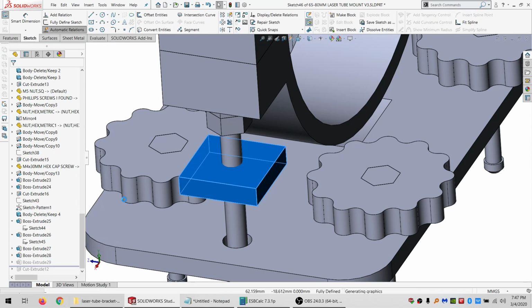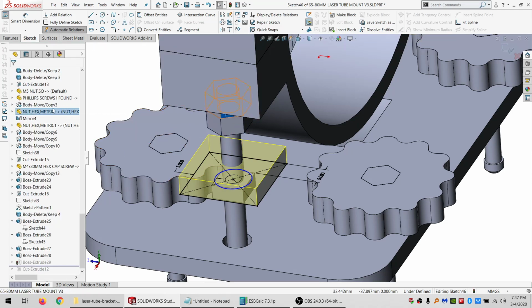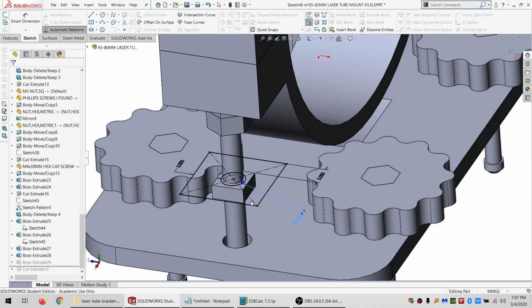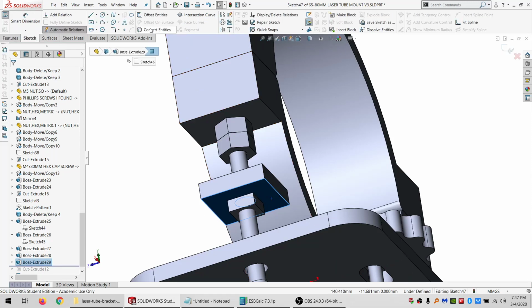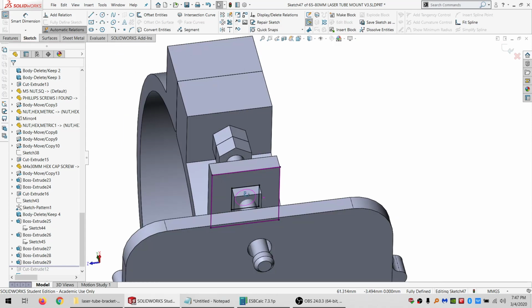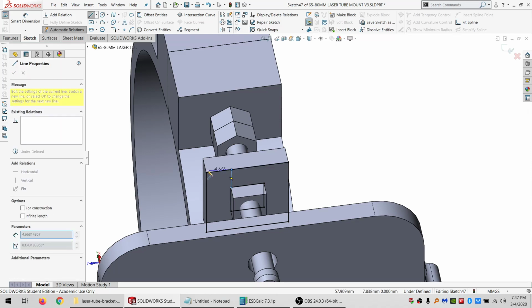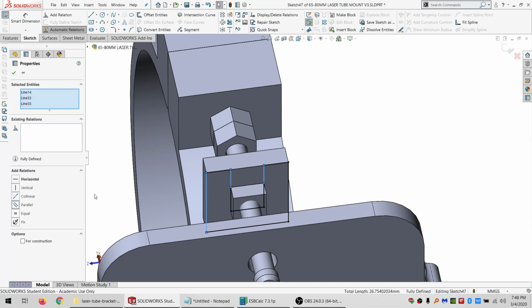And right away I already want to modify that, because I've got the screw. Let's see, this is M5, I believe. Yeah. Alright. So make a 5.1 hole in the middle of that, just so it can go through. And then I convert this, and put line here over to there, line here over to there. Make these for construction. And that way, I've kind of got a path here. I'm not completely closing it in.